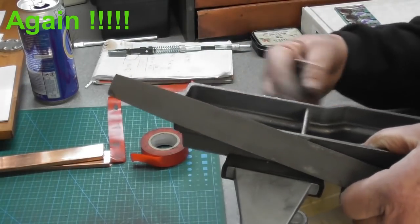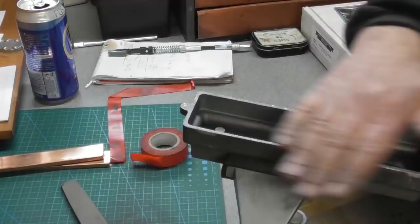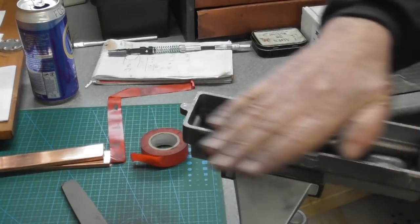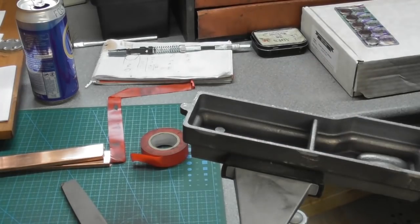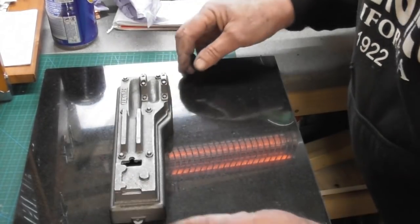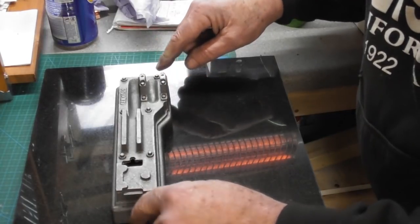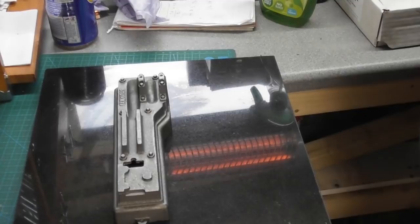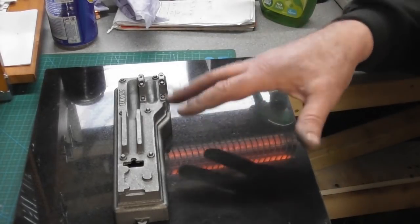Next question is to see how flat this base actually is. I can see a little few high spots visible after just running a file over the top. I'm going to get it on my piece of granite with some emery cloth and give it a rub to see if we can get it flattened up. I've put it on the flattest thing I've got — this piece of granite — and I think the word is: awful. So yes, we're definitely going to have to give it some emery treatment, and then look at perhaps getting some feelers under it to see how bad it is before thinking about machining it.